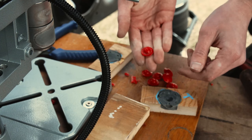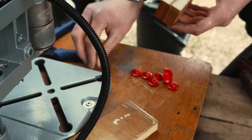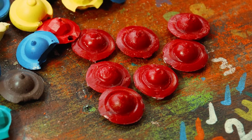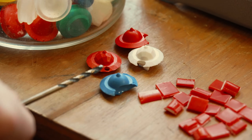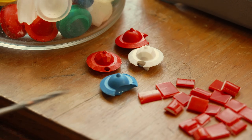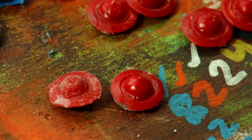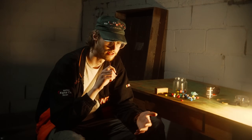I have noticed some tiny ripples on some of these, which I think comes from demolding a little too early — I'm getting impatient but learning something with each cast. Even if these models aren't perfect yet, for a two-day dive into mold making with only stuff I had laying around, this is a huge success. Not a single one of these flying saucers had any air bubbles in them at all, which was a huge predicament with resin casting. This is big — I'm excited. Even the difference in results from the first test with silicone to the current attempt with epoxy is dramatic. I've only been messing around for two or three days with stuff I already have and it's shown a lot of promise.